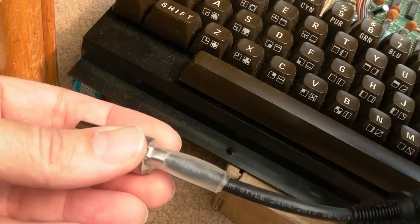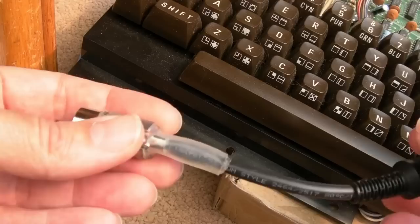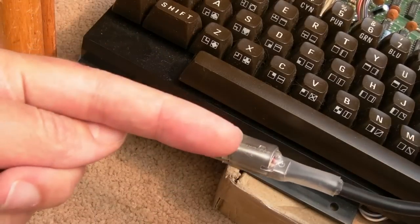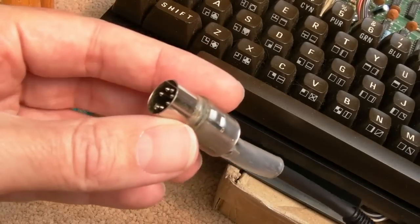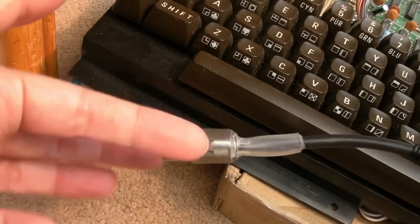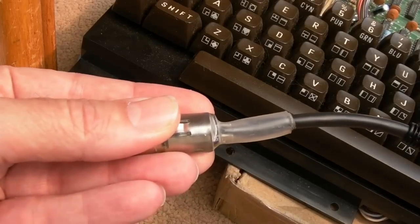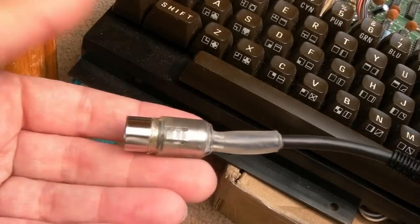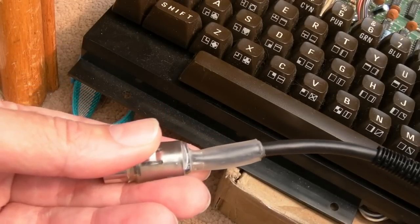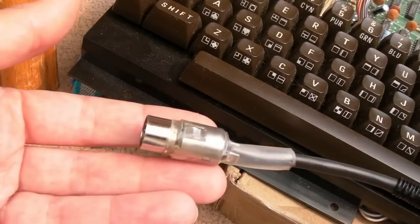And because there were some chips missed off the board, quite a few, at least 2 or 3, and because it's hot in here, the power supply was going marginally above the 5.35-ish volts before this kicks in and goes, oh, you've got an overvoltage. I know that's the issue because I later had exactly the same problem again with another board, and when the board's fully populated, no issues at all.